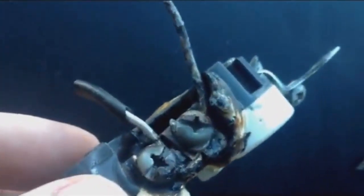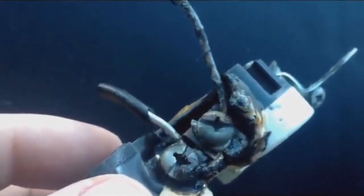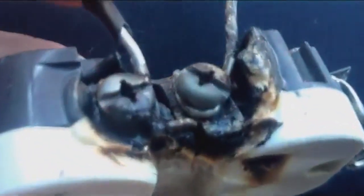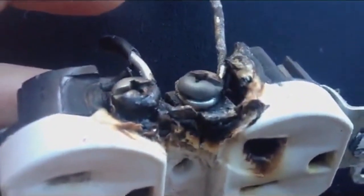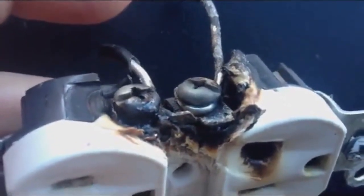The reason — and we've been talking about how over the years aluminum will expand and contract and stretch and then go back far faster and far more readily than copper — this is exactly what's happened here. Over the years this has gotten loose, and as a result created this horrible situation: arcing, which means literally the electricity is jumping through the air to go from contact to contact.